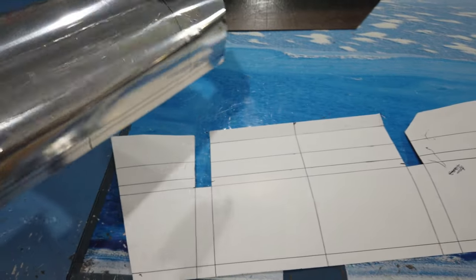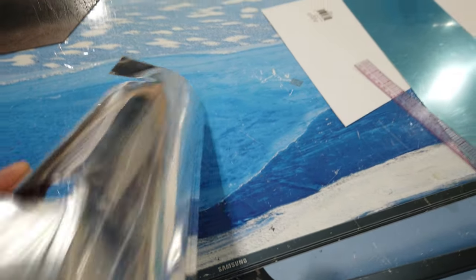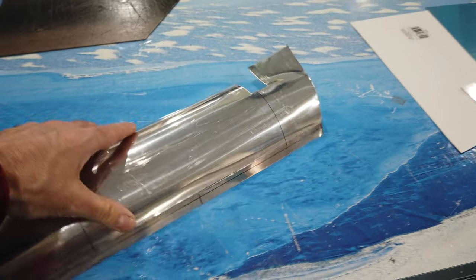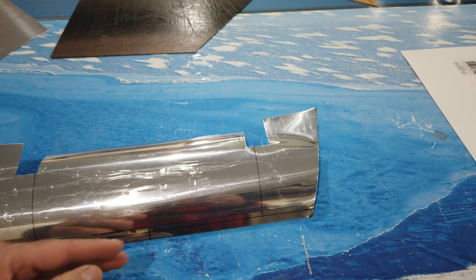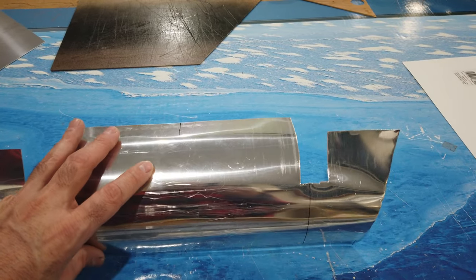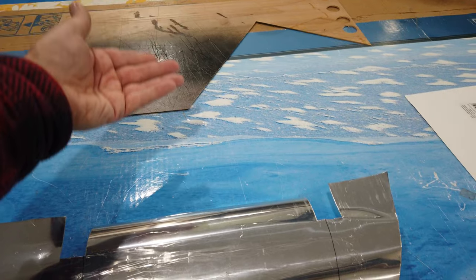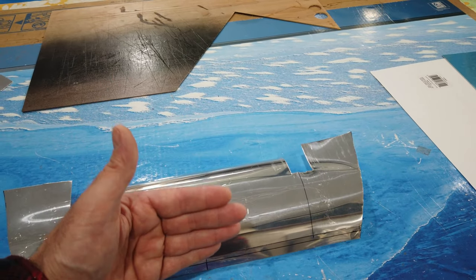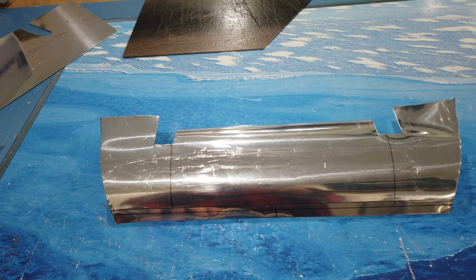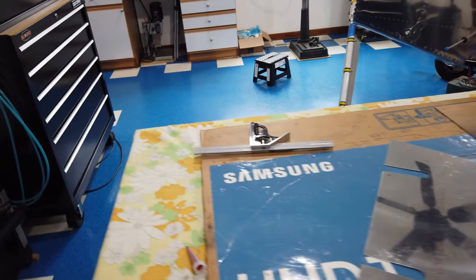You can get a basic idea from the shape — it's just a contoured piece of aluminum. Imagine this is the bottom edge of the fuselage, and this top area is ultimately going to be attached to the firewall. So if you imagine this upright in the airplane, the air would come down, shape itself, flow around this curved area, and out the bottom of the cowling. You're limited with what you can do because I've got all my other stuff fitted in the engine firewall-forward area.